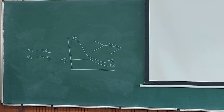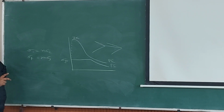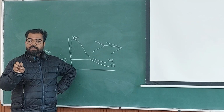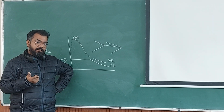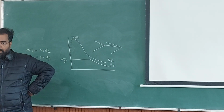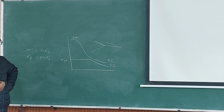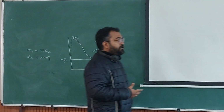Okay, for the same crack length, for the same amount of force applied, width of the specimen is same, a by W is same, everything is same, just if you change the geometry, then you will have different amounts of T stresses. Some of them will be trying to compress the material at the crack front, and therefore you will have to apply more stress, more energy you will need to supply in order to open the crack. Okay, and if it is tensile, then you need less.